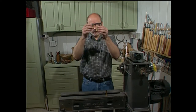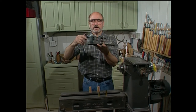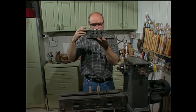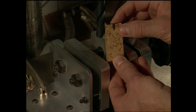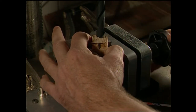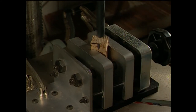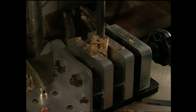Now that these are cut to length, I have to drill holes to receive the brass tubes, and those holes need to be perfectly straight. I have a pin clamp here — it's a really cool device that clamps in from both sides. Once you have this centered on your drill press, you can drill blank after blank without having to reposition. I'm going to drill from the grain-match end, not the other end, because as the drill bit comes through the bottom it'll break out the wood. I have my drill set at a slow speed, about 500 RPM. I don't want it too fast because it'll burn the wood and the heat could crack it. I want to pulse this in while drilling — that also helps minimize the heat.